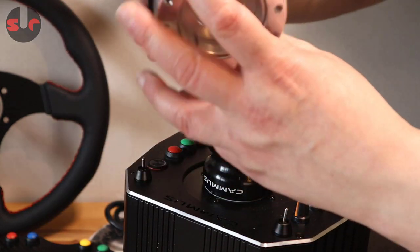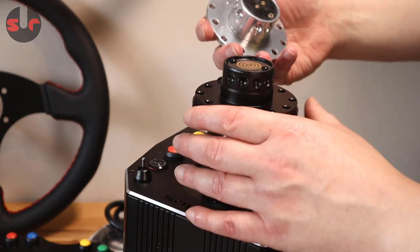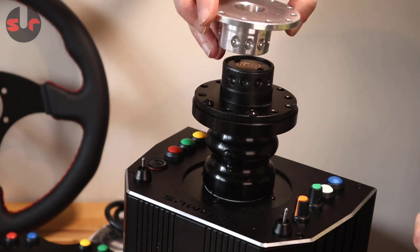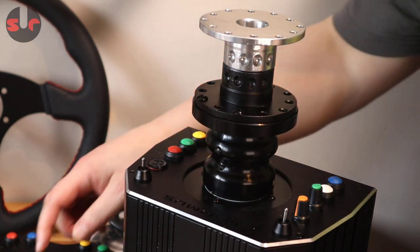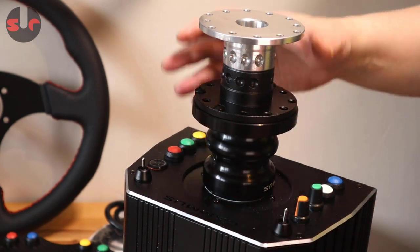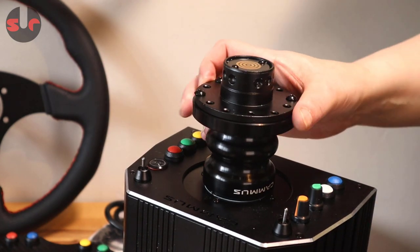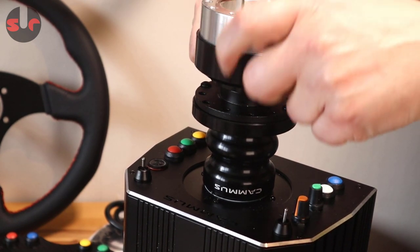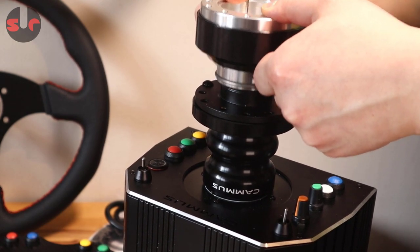Let me just show you how the D1 Spec lines up, because this is why it will fool you initially. You put that on there and rotate it — the ball bearing indents for where it indexes. These parts look the same, measured to the same standard, but this piece just doesn't work. Here you can see where it binds — that's as far as it goes. You can see the gap; it won't go down any further.